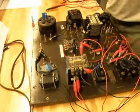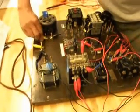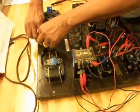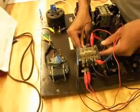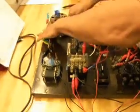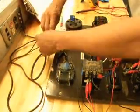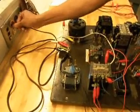Now to finish with line two — from L2 I'm going to the opposite terminal of my AC/DC universal motor that has not been occupied. From L2 I'm also going to the opposite end of my M1 coil. That should cause everything to energize very well once I plug it in. I'm going to take my laboratory test cord and connect it to L1 and L2, and plug it into the receptacle.